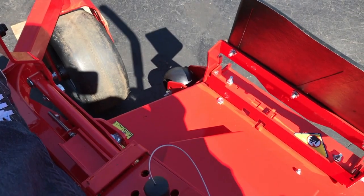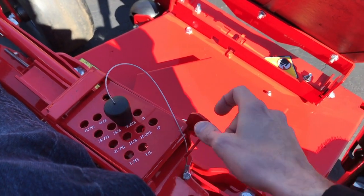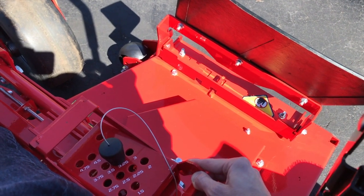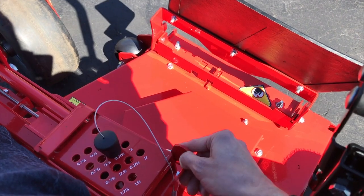To set the deck to transport mode, use the forward pedal — as you push that forward, you move the entire lower deck. Right down here you have a steel latch and a lever. By pulling back and lifting the front portion you can lower your deck all the way down; however, for servicing purposes we want this deck in transport mode, so go ahead and release that lever.